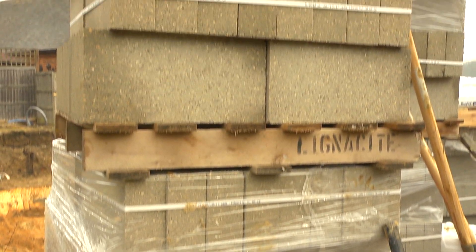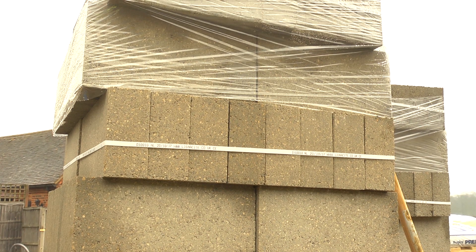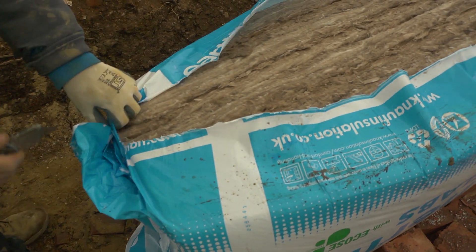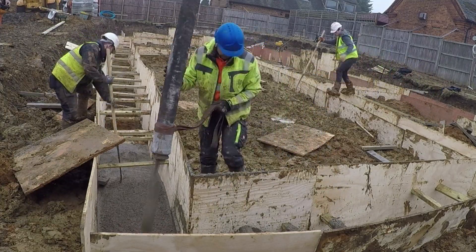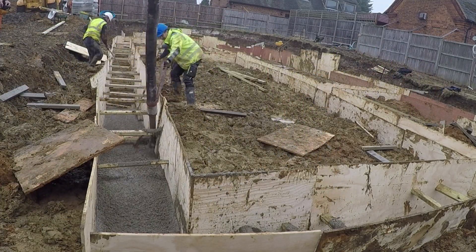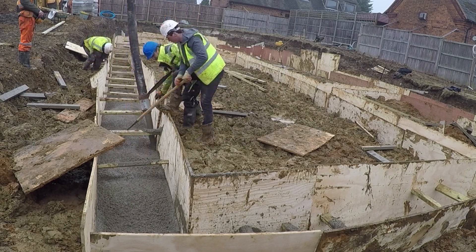What's interesting is it can all be achieved with familiar materials and using existing skills. We're building this as a traditional building — masonry rather than timber frame — and we're putting insulation in the cavity wall, so again very traditional, very normal kind of construction. The skills and materials are all available for everybody; we all know how to do it, there's just more of it. Building this way is also cost effective.